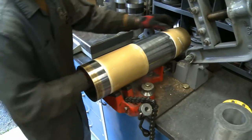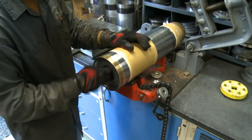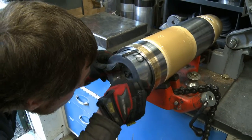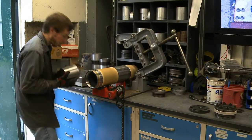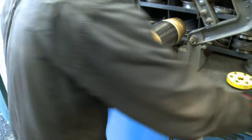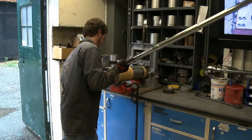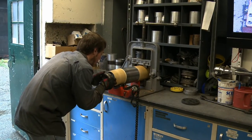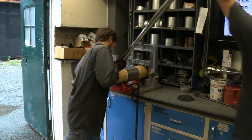The projectile was assembled by placing the body on a vise and inserting a forward stop, a spacer, and then the test articles. The onboard recorder is weighed, then the last to go in before the base is screwed on and torqued down to the proper setting. The round gets rotated, the nose gets screwed on and torqued down. This keeps the payload from shifting during its launch.